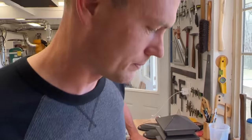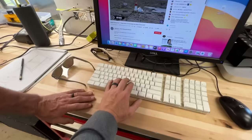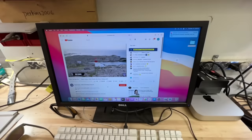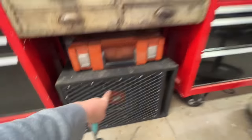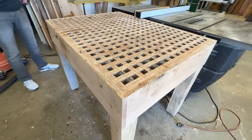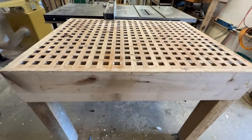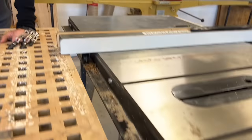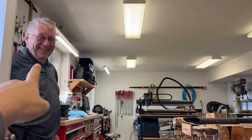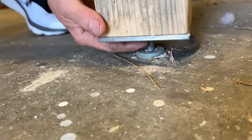He's got a brand new Mac computer here — with the oldest keyboard and monitor I've ever seen — and a subwoofer, which most shops don't have. Let's look at my outfeed table for the table saw, which is also a downdraft table: you hook a vacuum to the bottom and air sucks down through the top to catch dust when you're hand-sanding. It's the same height as the table saw and the workbench — 35 inches — and it has adjustable feet so I can fine-tune the height wherever it's positioned.